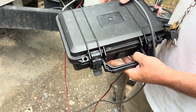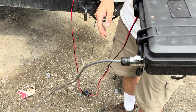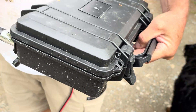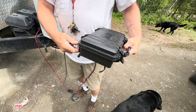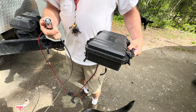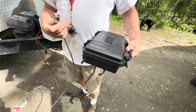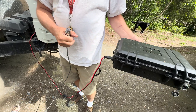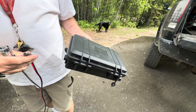I have a Gen 2 Starlink antenna, and with the Gen 2 — it might be the same with others, I'm not sure — the wire basically runs like ethernet cable. I cut the cable, there's a plug that comes with it on the end, but I cut that off and put an RJ45 on it. I got this plug from Amazon, and the little DC plugs are standard — you can get these at Canadian Tire or whatever, just a little 12-volt plug.